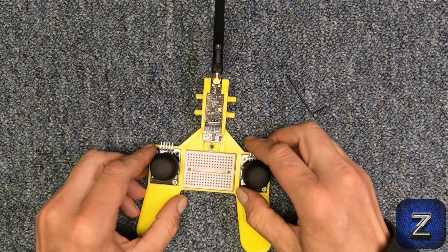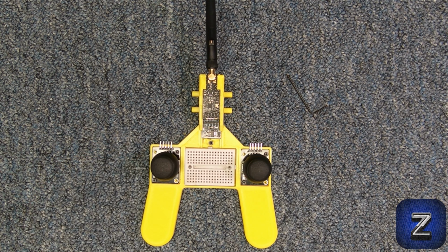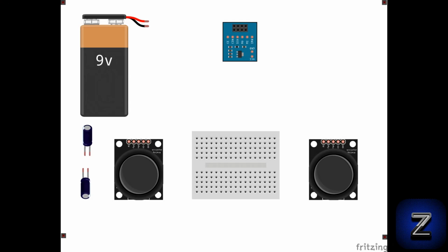I recommend you place all the components on the breadboard the same exact way I do. This board is small and limited in space for the connections. First, place the Pro Mini on the breadboard to the far right, with 3 open rows above it and 2 below. Next, bend the tabs on the voltage regulator in the middle back to a 90-degree angle. Then, insert it into the breadboard in the upper left-hand corner.